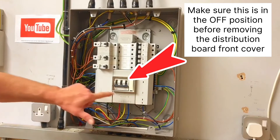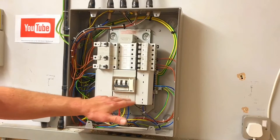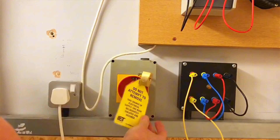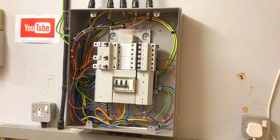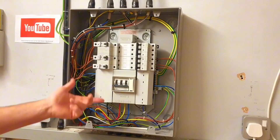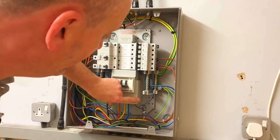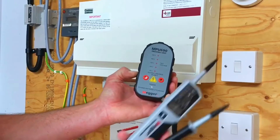At the minute we've got the guards in place so I cannot see the incoming supply cables termination points. I'm going to have to access this area here — it says 'Danger Voltage'. We're hoping we've isolated it remotely; we know the main switch is off, but care needs to be taken when entering this enclosure. We'll take off the side panels and then remove the front cowling.